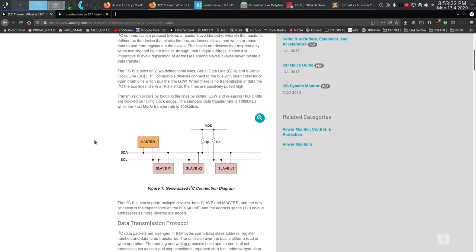If you remember from the previous video, I used this I2C connection diagram from the Analog Devices page — a lovely diagram to describe how it works. This diagram is partially correct because multiple masters are also possible. The I2C lines are passively pulled up by pull-up resistors and can only be pulled down by each of the devices in the network. The master is the only one that can actively start pulling these lines low, and only the slave can acknowledge when it's been addressed.